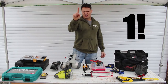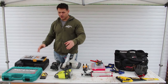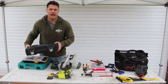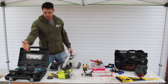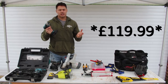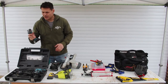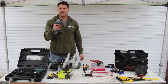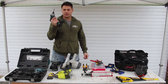Number one — the single most important thing — is actually two things combined into one rig: an impact driver and a drill. These are the 18-volt Erbauer versions, just over £100 from Screwfix at £119.99 or £129.99. I use these more than absolutely anything else on the build. The impact driver will only give as much power as needed — so if you're struggling to get screws out and keep shredding the heads, an impact driver is exactly what you need.